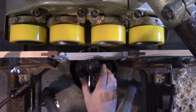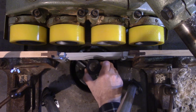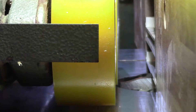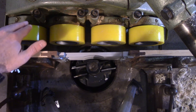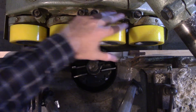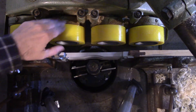One thing that's really nice about this limiter style cutter head is that it's easy to just turn the cutter head sideways and do a dry run with the machine off, just to make sure your power feeder is behaving the way you want it to. It should be noted that all power feeders would normally have a guard over the wheels — mine came loose and is at the other shop — so I would not normally run this without the guard.